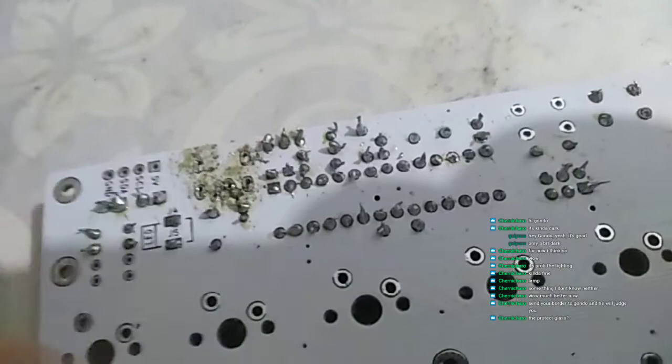they look like blobs, so you guys can see that the solder looks like balls, you know, they look fat. When in actuality, what you want, which is what I told you guys in a past stream, is that tent shape, like a circus shape, right? You want something like this. There is not much solder, but you don't want a ball of solder.